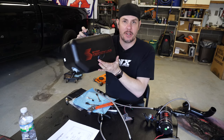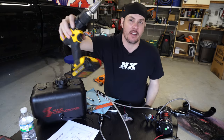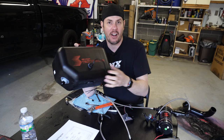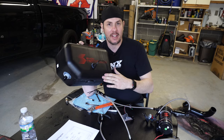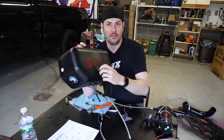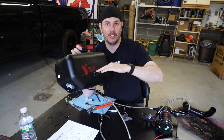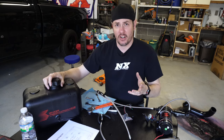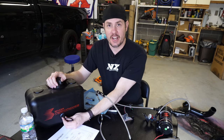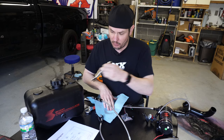On top of it, we have a level switch here that will give us an indication. You install this yourself — grab your favorite drill with a unibit on there, drill through, and then it's a compression fitting. Just tighten it down, fill the thing up with water, and verify that it doesn't leak. The big thing is that we want the float to be up, so make sure that the orientation stays the same as you drill it in there. That way, whenever there's fluid in there, the float is in the up position. And then whenever the fluid gets low, it will close, and that's what sends our signal to our LED or our controller to let us know that we are low on fluid.